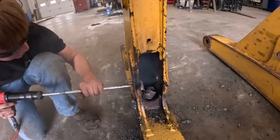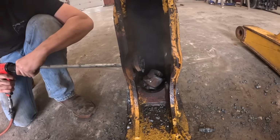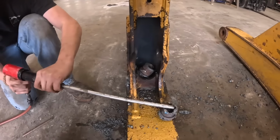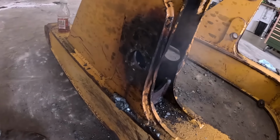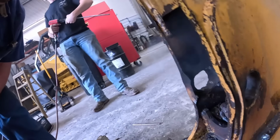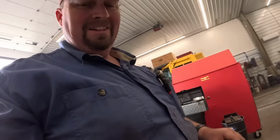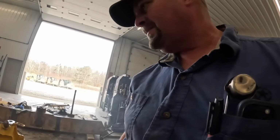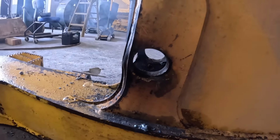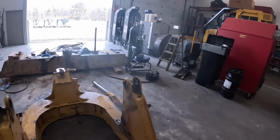That's a good one there, Paul. What'd that do to you? Look at that. That hole might be egg-shaped. Or am I just seeing things? Boy, oh boy. Well, that's the end of the destruction. We're gonna heat that up, hammer it back in. It's definitely got to be line bored out.